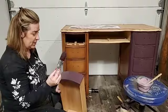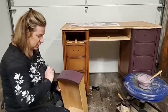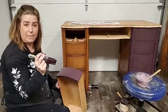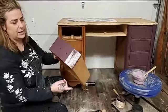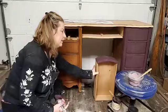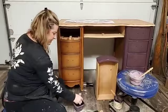The reason I usually use water when blending is because the paint dries to a chalky matte finish and can drag a little over another layer of paint. But this is my first coat so I don't need water. I make sure my brush strokes are all going in the same direction. Dixie Belle is a self-leveling paint, so if I give it a reasonably good start, most of my brush strokes will level out.